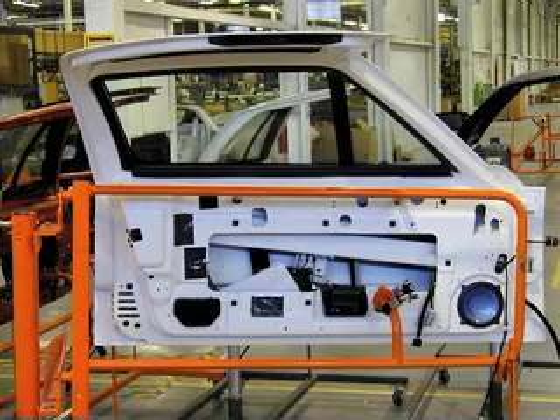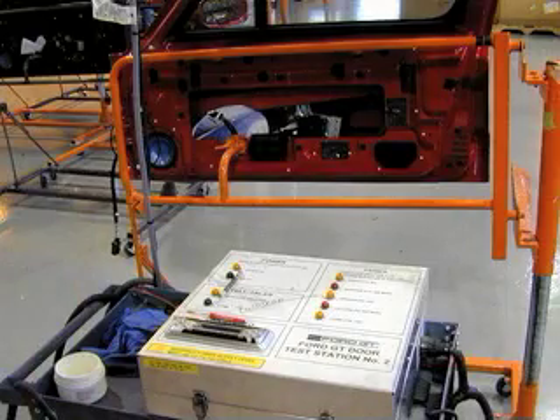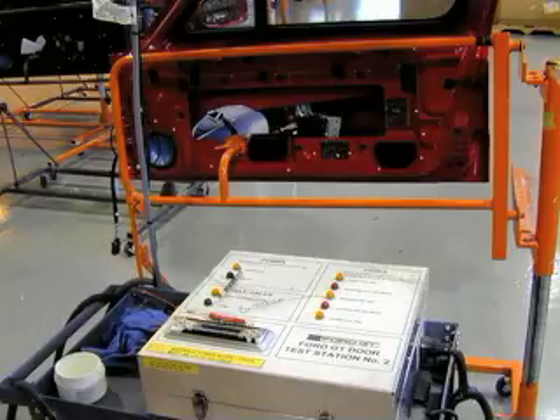The doors that were pulled at the beginning of chassis assembly are built using a separate process. The window regulators and wiring harness and door release switch are installed. The doors initially took three days to build — now it's down to one hour. From the speaker to the window switch to the electric door release, each is tested before the door ever goes on the car. The window regulators are also timed to see how long they take to raise and lower. If any component is not to spec, it is immediately replaced.